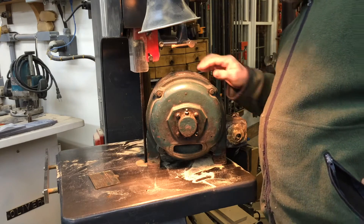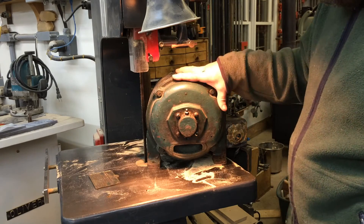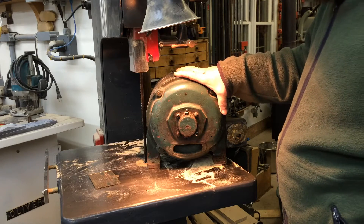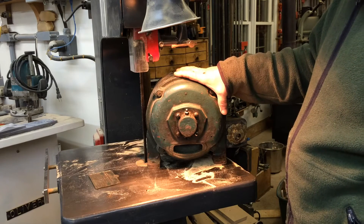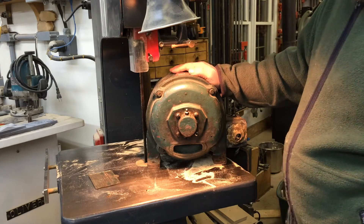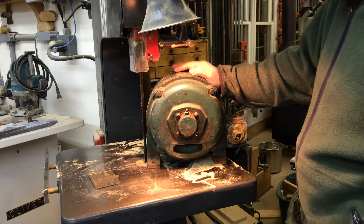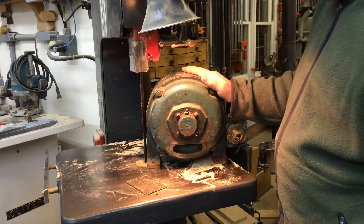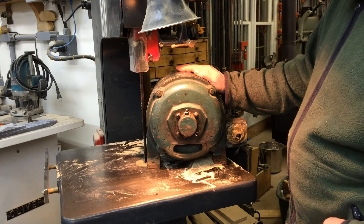What's interesting with this motor is I scraped off — it was rebuilt, I picked it up. It wasn't very expensive. I needed a slow speed, one horsepower, 1160 motor to lower the speed feed rate, so when I did moldings I could get a feed rate of 15 feet a minute. The molder is a two-knife cutter at 5,000 RPM, and that's an ideal feed rate. I was going to do it with a variable frequency drive, but found it was simpler to just find another motor.